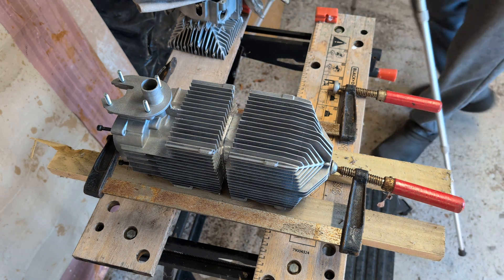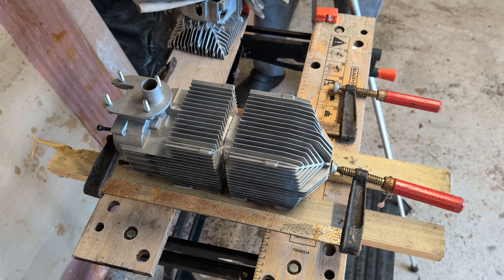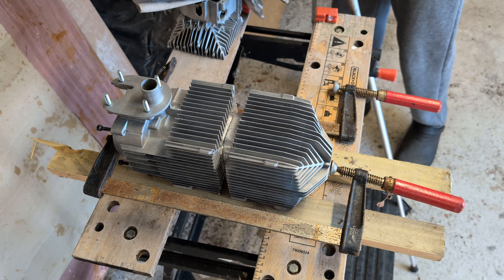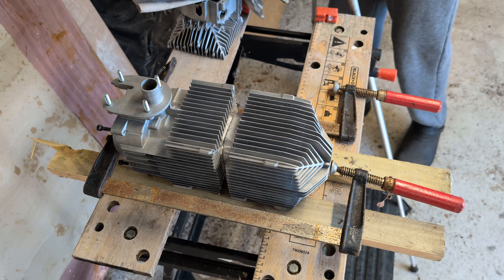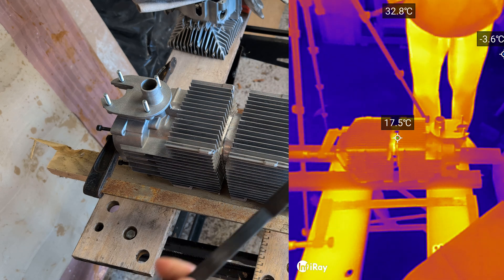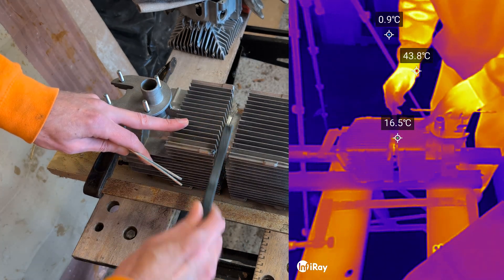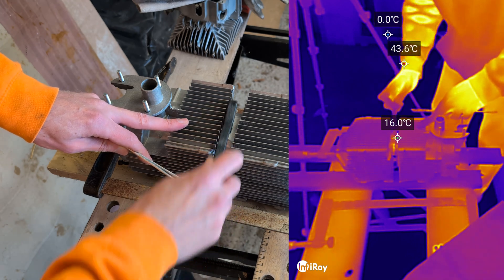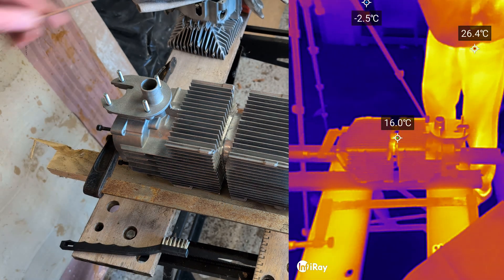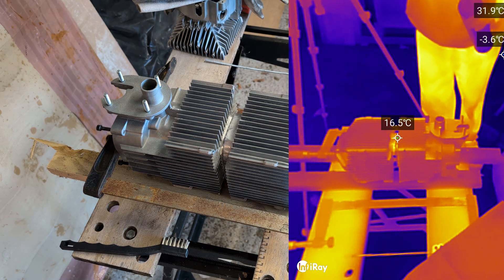The thermal imager is going to be on the other side for reasons. I've got the emissivity set to 0.4, which should be about right for that roughness of aluminium - roughly. Right, the LumiWeld kit. You've got a stainless brush for removing the aluminium oxide - not that there should be much since I only just did the grinding. And then we need to heat it up to 300-400 odd degrees and get it to stick. So, we have the blowtorch. And here we go.